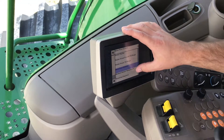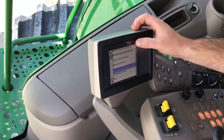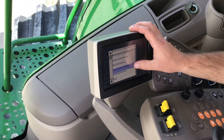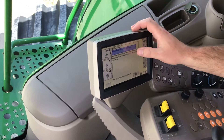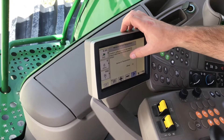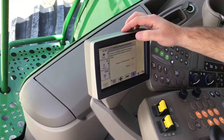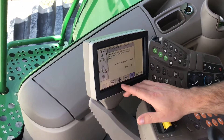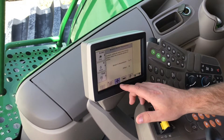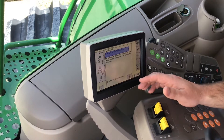The moisture sensor calibration is just a simple temperature calibration. Again, I went to this box under Calibrations, and instead of Mass Flow Vibration I now go to Moisture Sensor Temperature. I hit the accept arrow and it gives me a temperature reading — it says 68 degrees. Right now outside it is about 75 degrees, so I'm going to put an offset in to make this read 75 degrees, then hit accept. That's all there is to the moisture sensor temperature calibration.